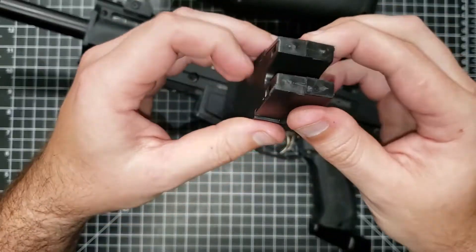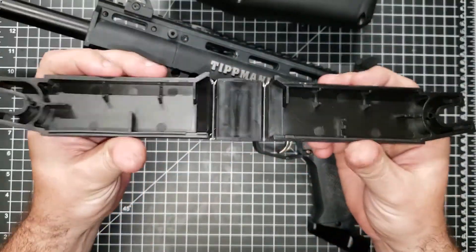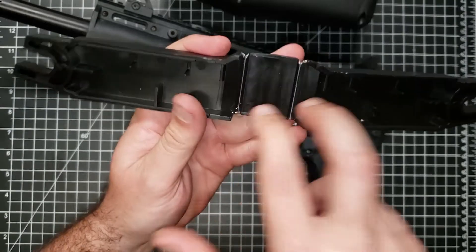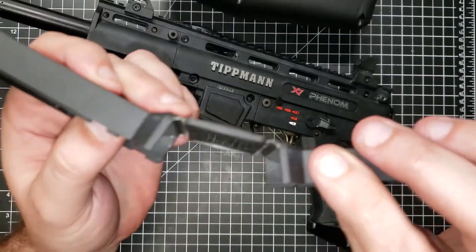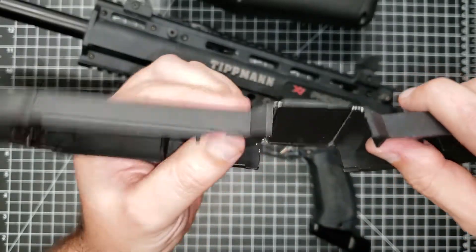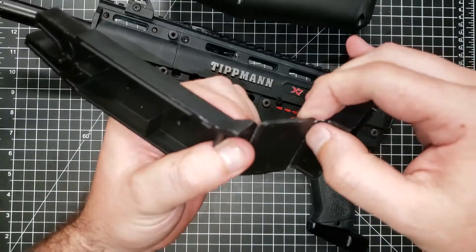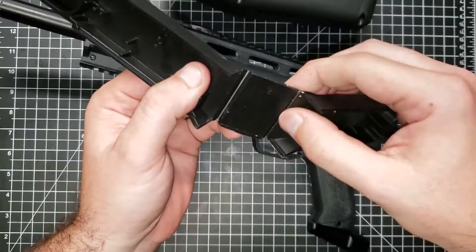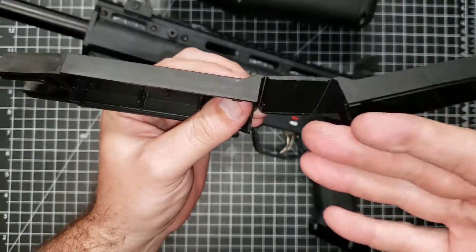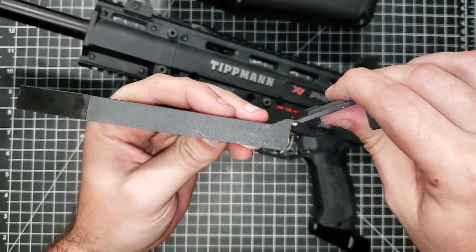So what this is — it's a single injection-molded piece with two living hinges. They're very thin places in the design that are meant to be flexible. That's called a compliant mechanism, and there's a whole expertise and science that goes into producing living hinges, because it's insanely cheap. You don't have to do anything to make it a hinge — it's built into the plastic.